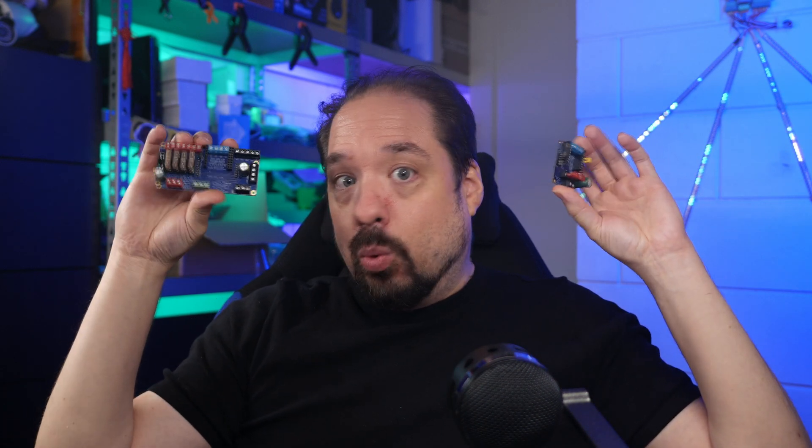A lot of people watching this will be wondering what I use on my boards — the Dig Uno and Dig Quad. Well, to be honest, this has evolved over the years. I started with no resistors, then changed to 51 ohm resistors, and on the last revisions of the boards I've settled on 249 ohm resistors.